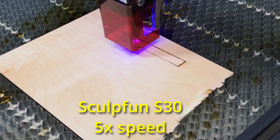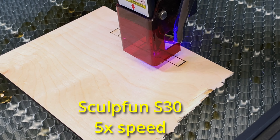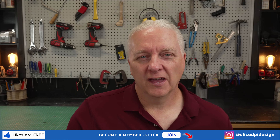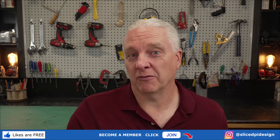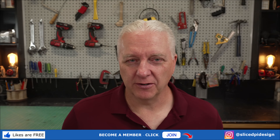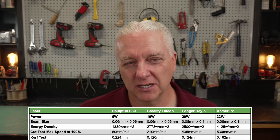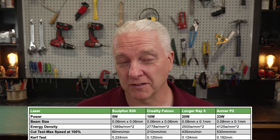The last piece of information we need to dispel some of these myths is a kerf test. I killed two birds with one stone here — I determined the fastest speed I could run the test and cleanly cut through the material, so I could then measure the kerf. While doing that, I timed the test, so we get both the kerf and the time it took, and we can determine how much faster or slower a given laser of a certain power is. I rolled all of it into this table, and you can see the first two rows come from the manufacturer's spec sheet. The power can be a bit dubious because manufacturers like to mislead us a bit, but I did my best to determine what the actual power at the output of the tube is.